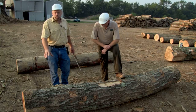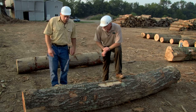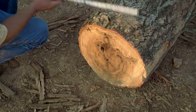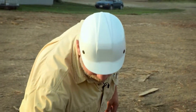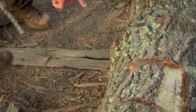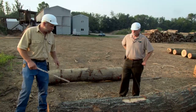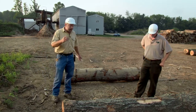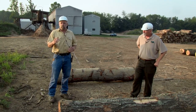This is a red oak log — it's a poor quality, rougher red oak log. This log has good diameter on it; I think we're looking at about 17 inches on that end. But this log in particular, you can see we've got some defects. There's knots here, knots here, and there's even a dead stob coming out of it. When we saw that board, we will have knots showing up on the lumber. If you just had one or two knots, that's not a problem — we can make our cuttings around that. But this log has a lot of knots down various different sides of it, so you cannot get those good, clean, wide boards without knots.